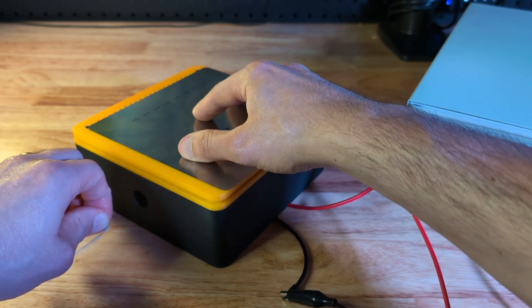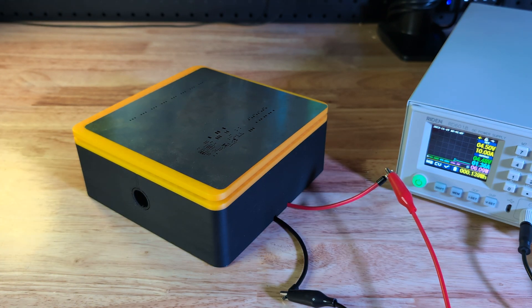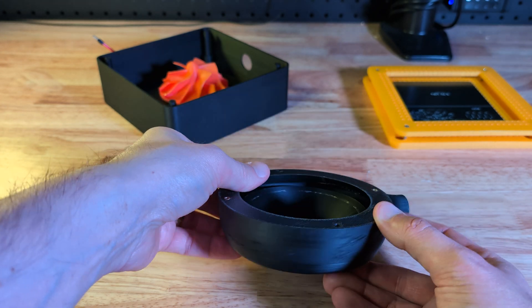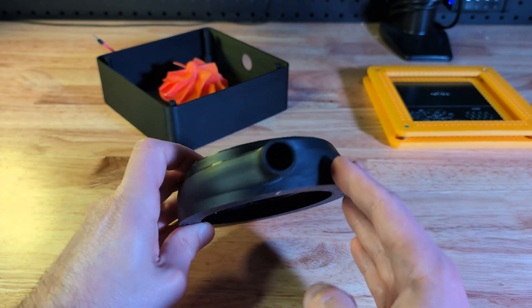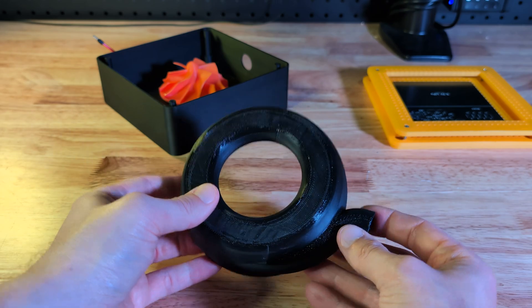But all is not lost — there's a lot I can learn from this. First off, I need stronger motors and they need to be more compact. The obvious choice are brushless motors. I'm also not at all convinced that the teapot is the pinnacle of design. It creates a really hard-to-print edge in the torus and the design is constrained by the air that can be moved through this pipe. Not sure it really is a concern here, but it doesn't feel right.